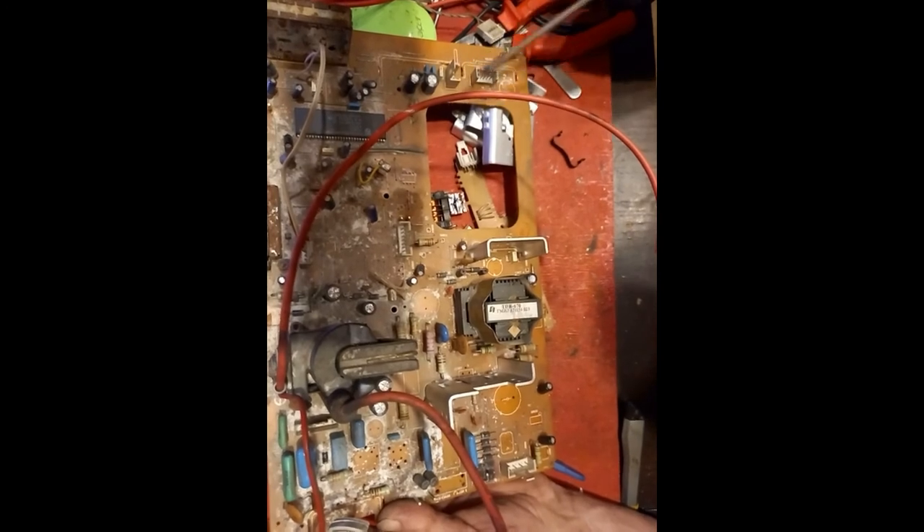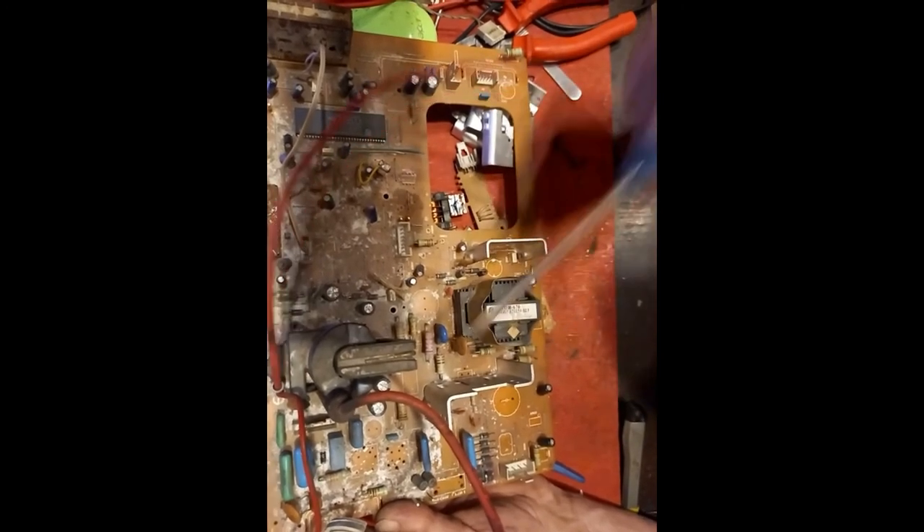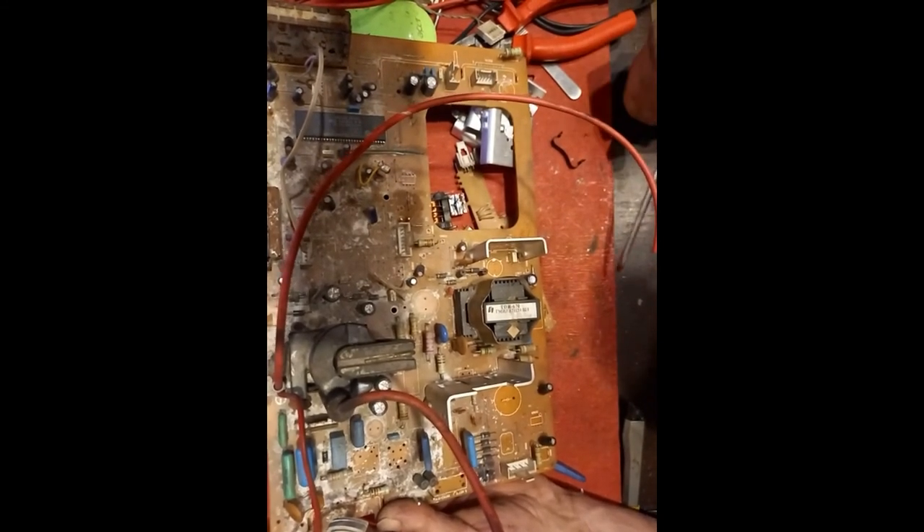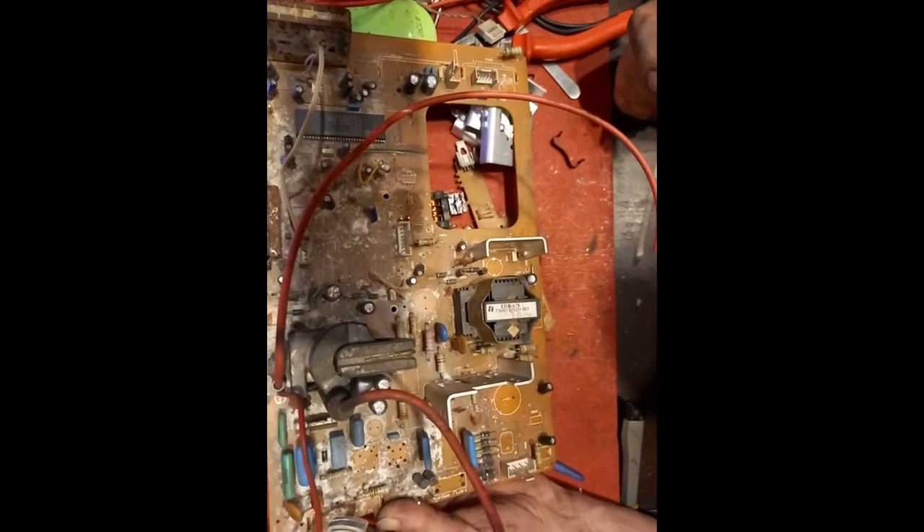Even the connectors I've reused before — if you want a connector, these are already made: just pull them out, stick them on your second board and you've got the wires, hopefully long enough for whatever you're doing. Fantastic quality parts. That concludes this video — this teardown of this old TV. If you found something useful, give us a thumbs up or drop us a comment, and subscribe if you haven't done so already. One thing to remind you: if you take old TVs apart, especially if they've been switched on, be wary of the capacitors — some are very high voltage and they'll make your hair stand on end, if it doesn't kill you.